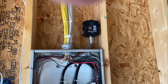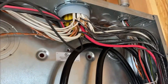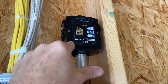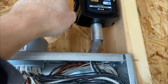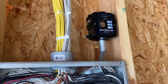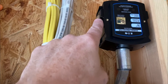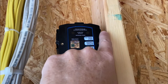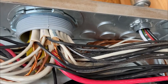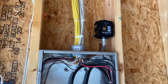Good luck with your project. It's very simple: half-inch steel coupling, half-inch offset nipple, and a half-inch ring that goes around it — just snug it up real tight. This little lip goes all the way around and should be the only thing around the sheetrock. If you're cutting this in, cut around the whole SPD — there's a kit that comes with a plate to cover all that, with two screw holes on each side to cover the sheetrock. Slide it in, and choose one of the front knockouts if possible. Good luck — hope you've learned something.